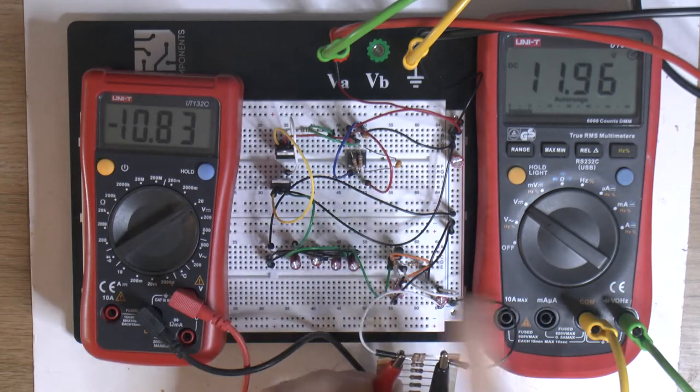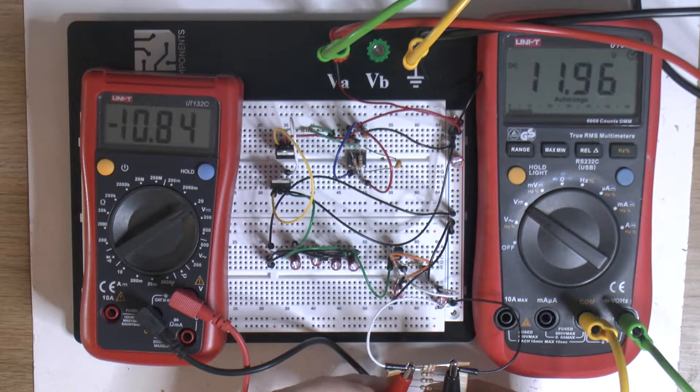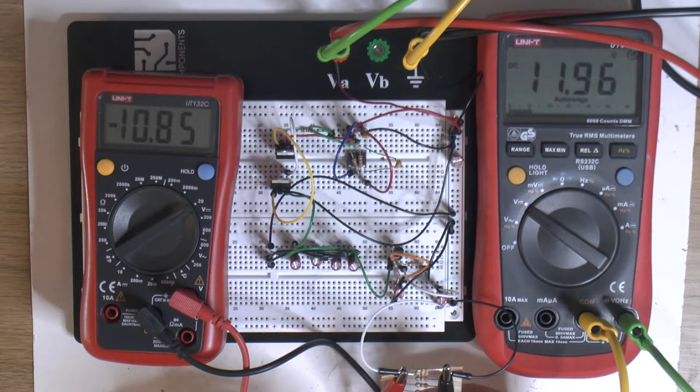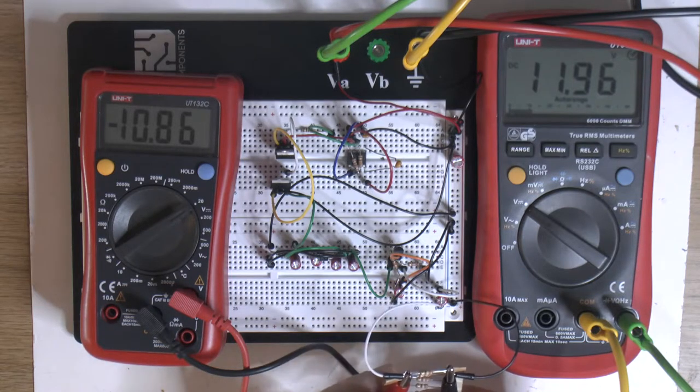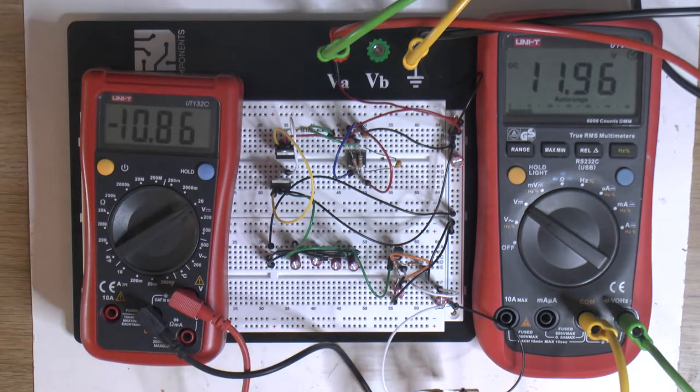This is good for about 50 milliamps, which is not a lot. A typical AT power supply usually has about 800 milliamps on the negative 12, and some are even 500 milliamps. So this is like a tenth or less compared to a typical power supply. But very little uses negative 12 volts these days, and this motherboard doesn't generate its own negative 12 volts for the serial ports, so if we want to use them we have to figure something out.